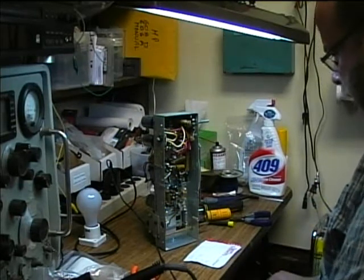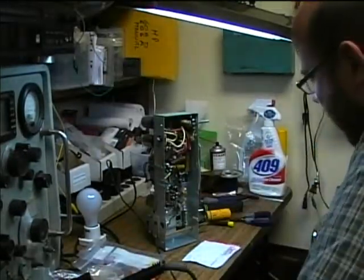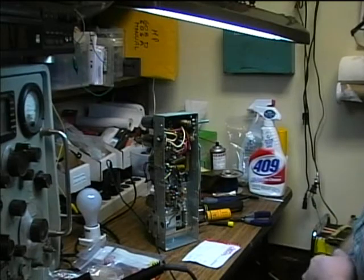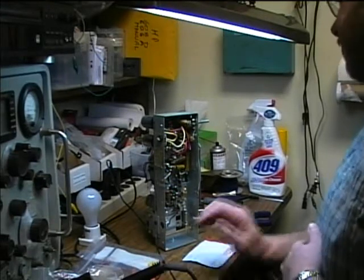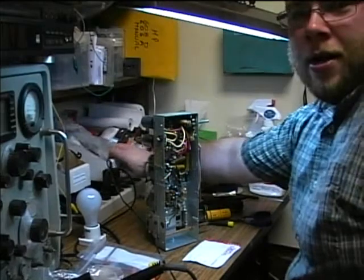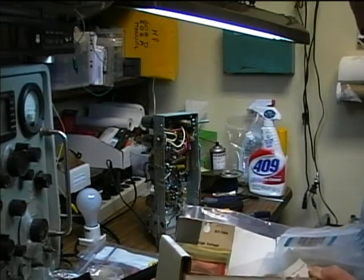Now I'm going to gather up the capacitors I need. Going to my high-voltage capacitors — here we've got 0.047s, here we've got 0.1s. This cap actually couples the power line ground to the chassis ground. I think it'll be okay to use the original value, but I do have some other 0.047s. Let me go to my bin of capacitors and see what else we have — looks like we've got 0.001s, we've got 0.0047, and I think that'll substitute for the 0.006.